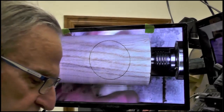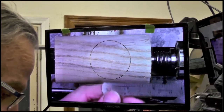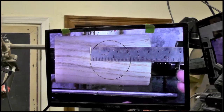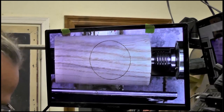Now, this will be a smaller diameter because I reduced the size. The size of this sphere is going to be one inch and five-eighths, or 41 millimeters. For Martin and Paul, it's 41 mil. So I'm going to jump back to my roughing gouge.